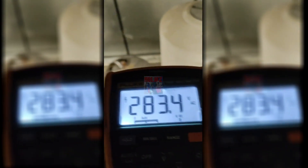I'm getting 277 to ground but not getting it to neutral. Hold on — you're getting 280 to ground, that's to ground, to the box. But to the neutral — I'm going to have it on my neutral if I can actually hold it there.